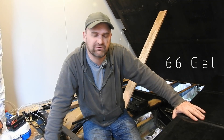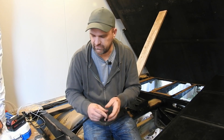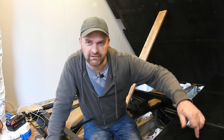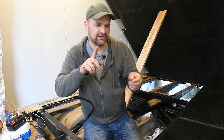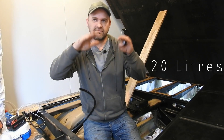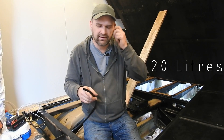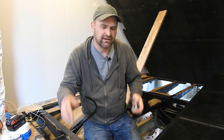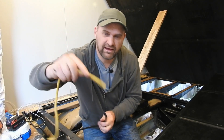I'm not putting a huge amount of water in this truck — these two tanks joined together hold about 250 liters. I'll be looking at ways to get fresh water from streams and I'll do some big filtration systems in the future. One thing I'm going to do to maximize the water capacity is make sure the vent pipe is right at the top of the tank. The vent hole is in the side near the top, but there's still some air space, so I'm going to bend the vent pipe so it goes up to flush out most of the air.